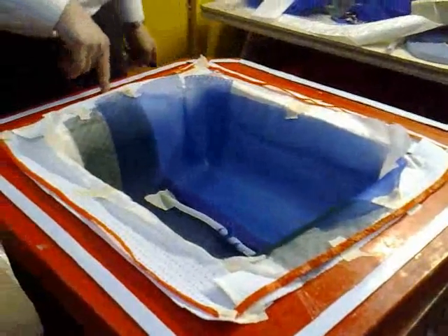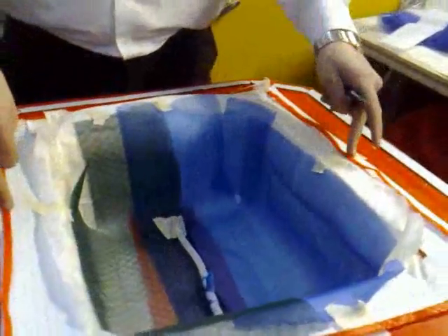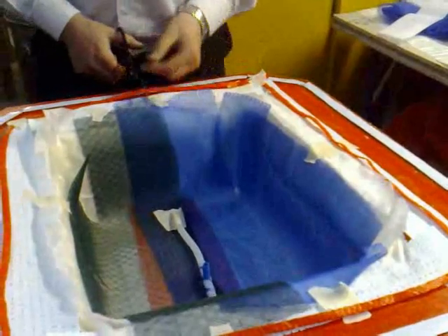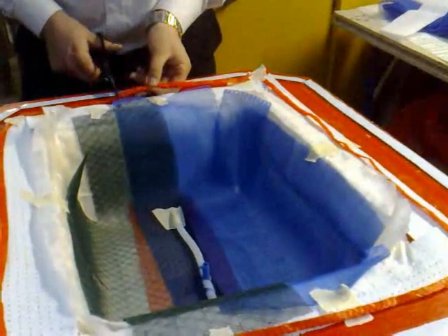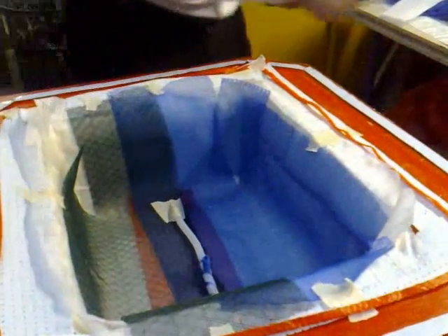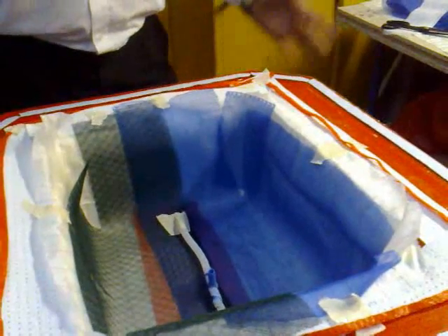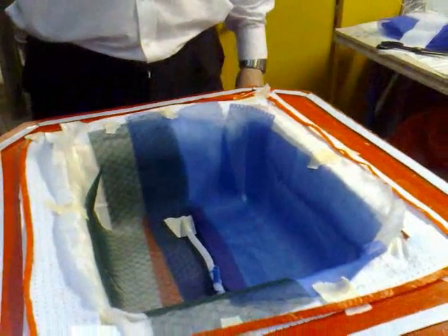What I am going to do — because I've got two different meshes on here, I want to control the resin flow on each side — I'm going to have to have two vacuum outlets, which are going to be here and here. So I'm actually going to put a break in this infusion braid material. Obviously with just one mesh, only one outlet would suffice for this size mould, is that right? Yeah.